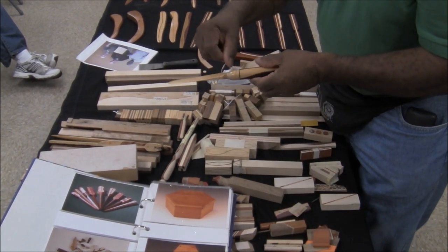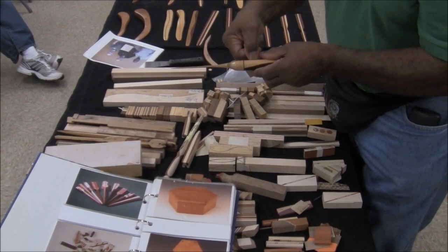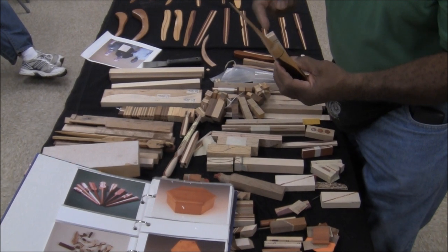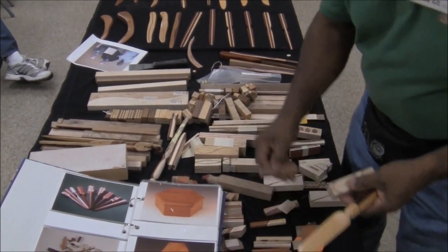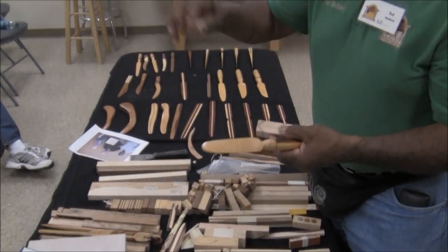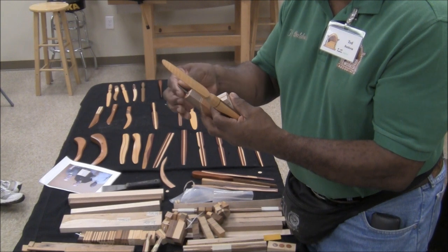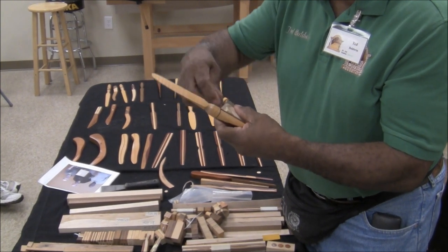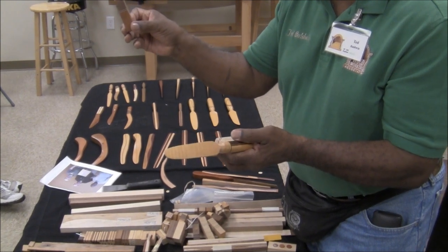all right, and I have wood, I usually put a screw right in here, a sheetrock screw. You drill a hole in the center of this one. I usually run the screw up in there, then I back the screw out. I cut the head off the screw, and I put it in backwards with some pliers. So the screw is in this part.